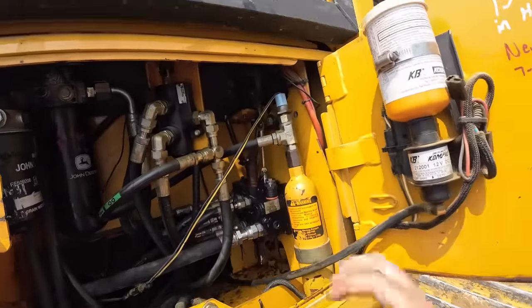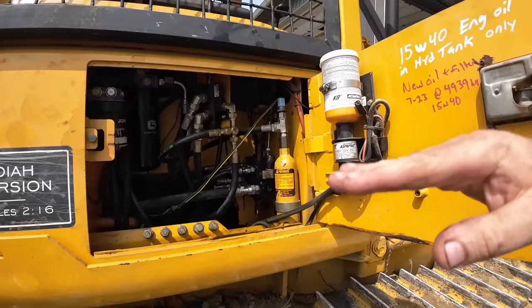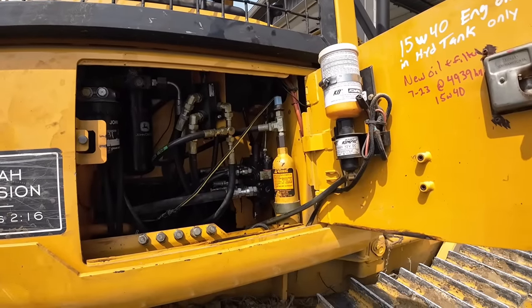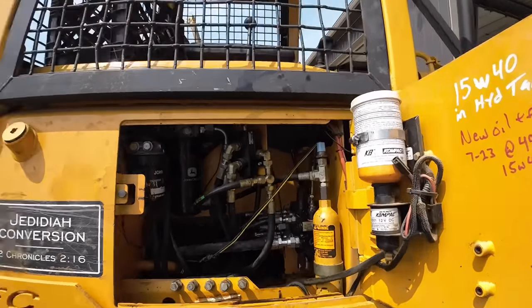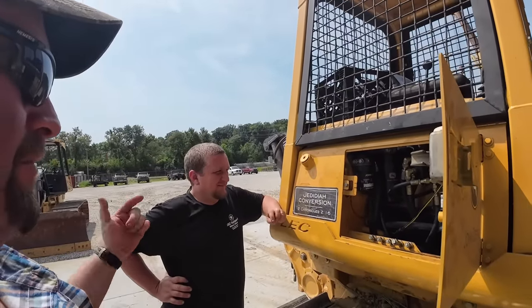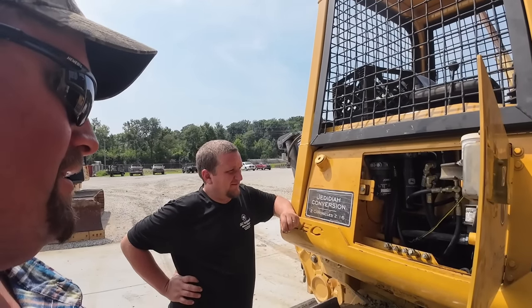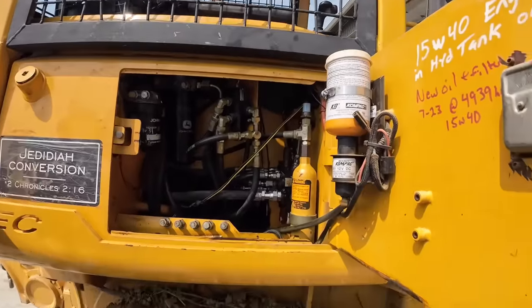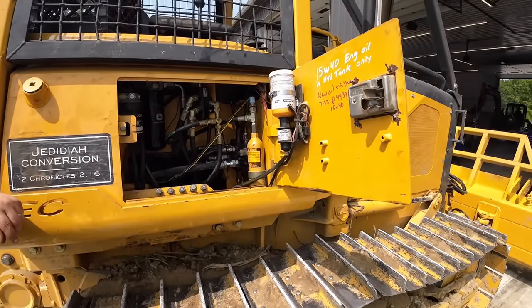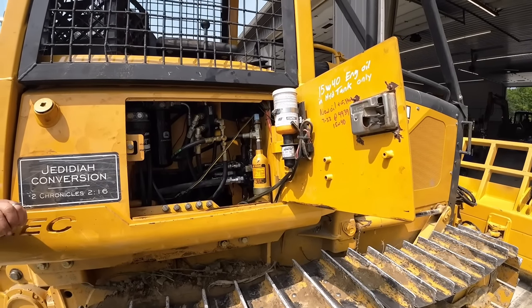We never saw anything in the other valve. It's got to be a crack, doesn't it? I mean, the spools are all centered. If a spool wasn't centered, it could be doing that, but is there any way to test that, Magnaflux? Something expensive, probably. Well, I'll tell you what, our people in the comments are going to drop something. We'll keep it in a box when this video comes out. If you guys got any good ways to test the old valve body, we might try that and do a video on it. I know Magnaflux, but I don't know if that would work that well. I guess it might. It's just a really weird situation.